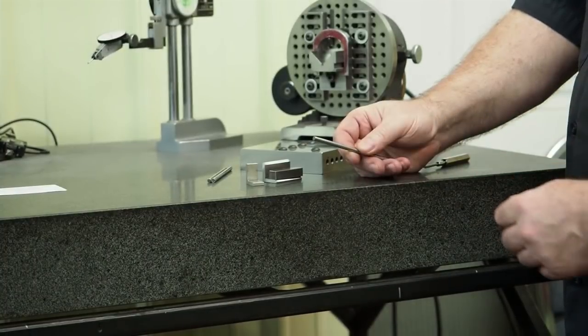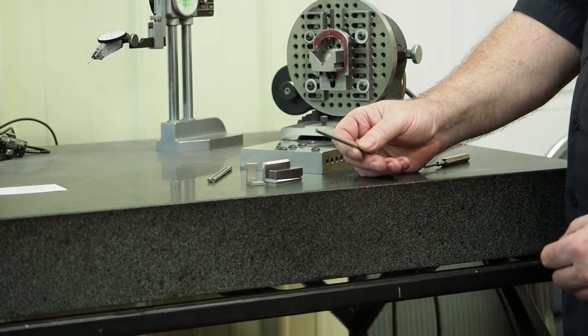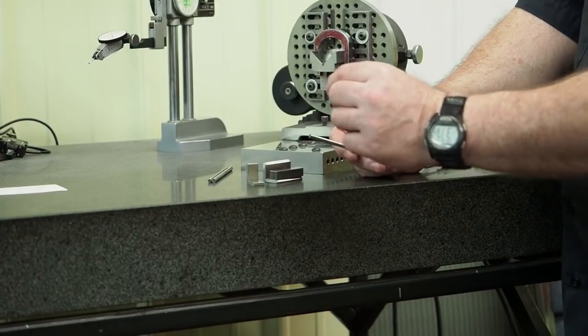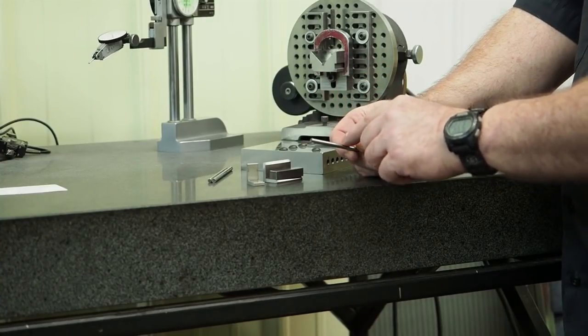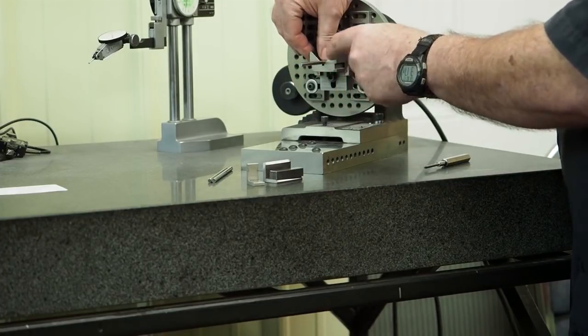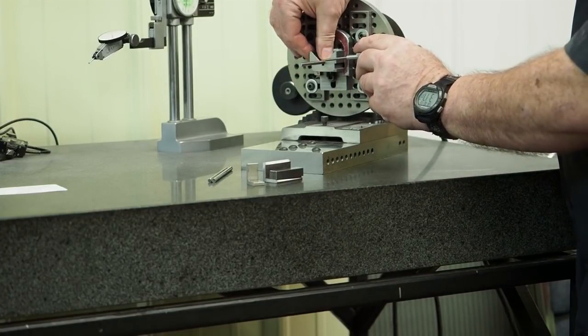He had to have it ground down to 150 thousandths in diameter. When I used a 46 grit wheel and even dressed and relieved most of it, I could touch here in the back when it was mounted up in the V-block.